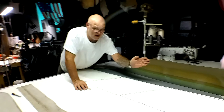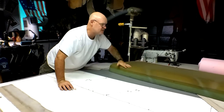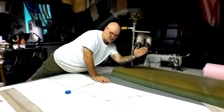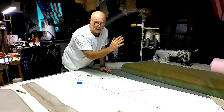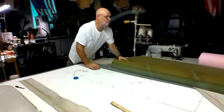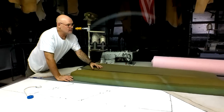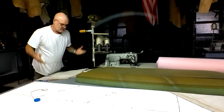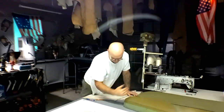What do we revert to now? Is our line true? Where these two pieces of individual fabrics meet, they have to be true. A straight line. So this has to be straight. This has to be straight. That has to be straight. There can't be no wiggles in it. And then when you put your anchor on, you can ride that on the edge of this foam, and the eye doesn't lie. Winning. You got it. And then the welt cord goes around here and around and dives down.